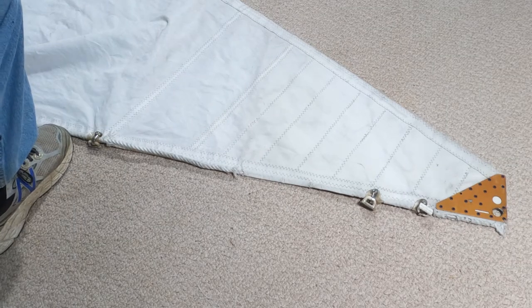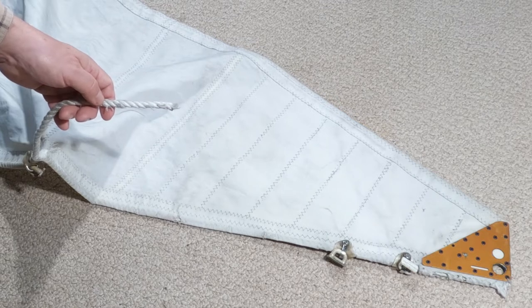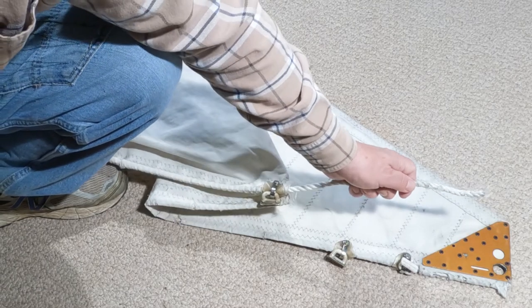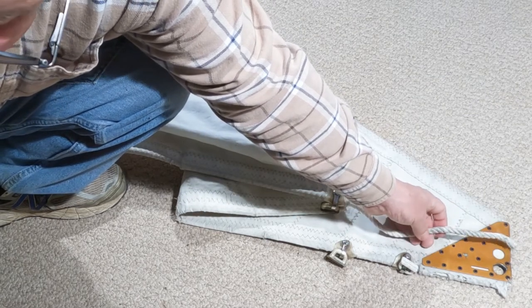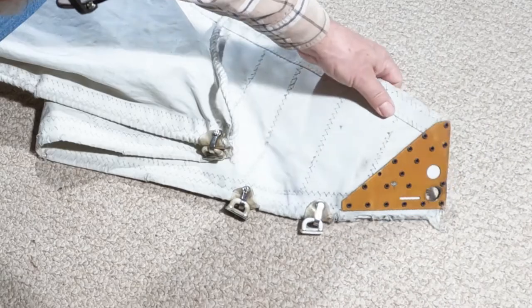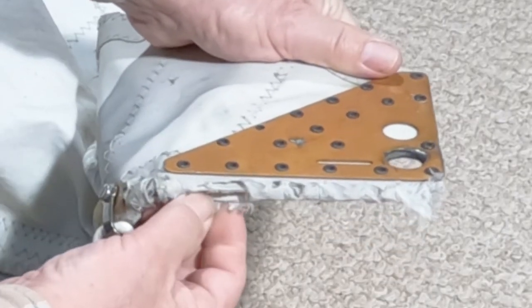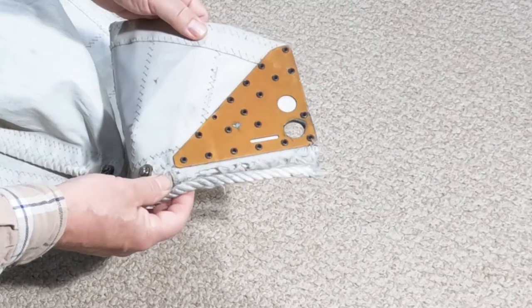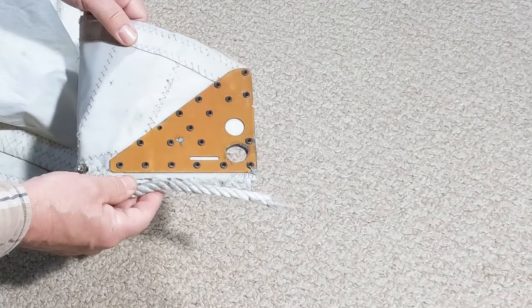This rope is pulled by the halyard to help shape the sail cloth — creating great depth for light winds and stretching tight for a flat sail in high winds. This rope is supposed to go all the way to the top of the sail's head and is then hand-sewn to the head with heavy twine. When we look at the sail cloth next to the headboard, we can see where the cloth has large tear-outs that were torn into it by this heavy twine. Sewing this rope next to the headboard — this bolt rope repair may fix the leech problem that I witnessed last season.